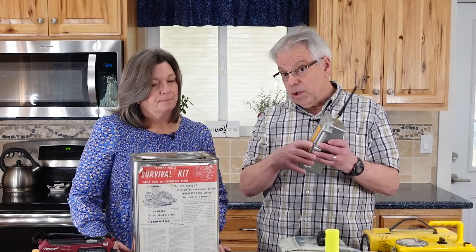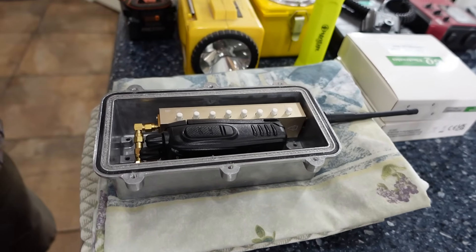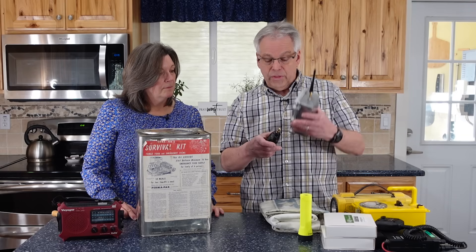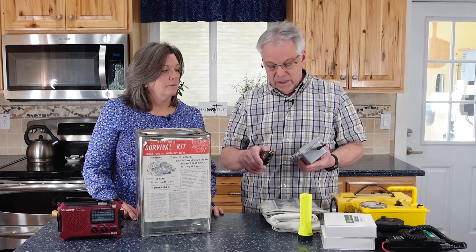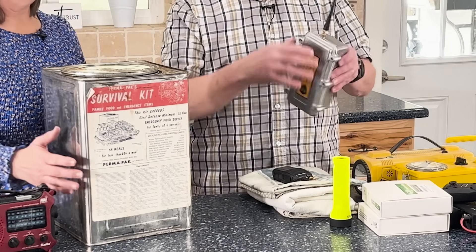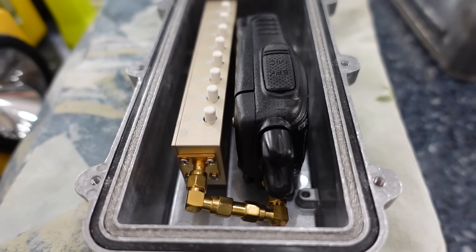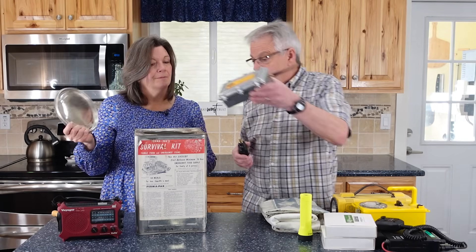We can test how good this is by using this device that Dr. Arthur Bradley developed — this is a Faraday cage tester. Basically two radios: one in here, one here. This one has the rubber duck antenna off and just a little connector, because with the big antenna it's too much energy to accurately test. You can see that because this can receive the signal, this is not protected. There's an attenuator in here that will allow us to figure out exactly the level of protection, and the other radio is in here. So this device allows us to just test and see if this is a good Faraday cage.